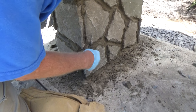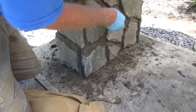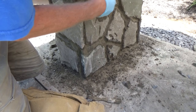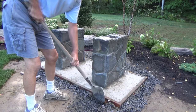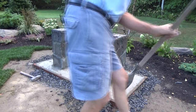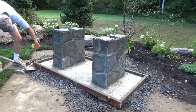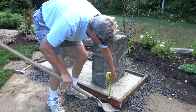Just like on my other videos — break it out, use the paint brush, rinse the sponge, and wipe over the top to clean all that cement off. Always make sure to rinse the sponge out. I went back the next day because it was too hot and I was too lazy to finish that day. I got the forms up one and a half inches all the way around and put the level on to check it.